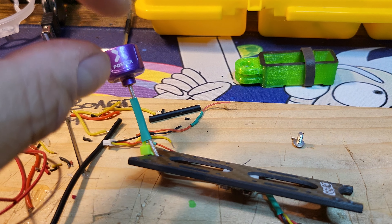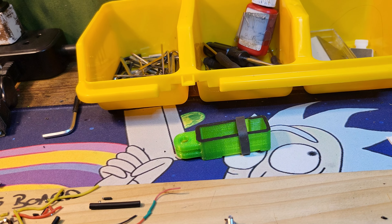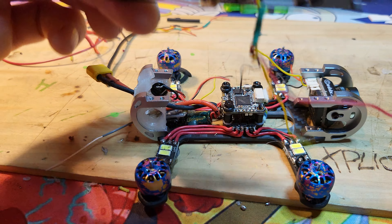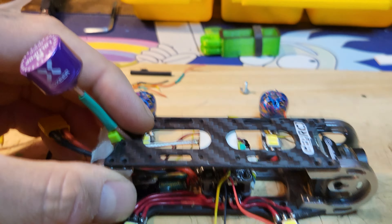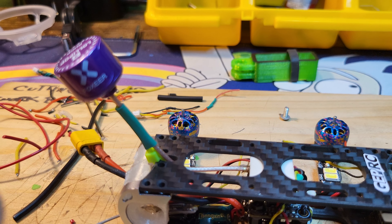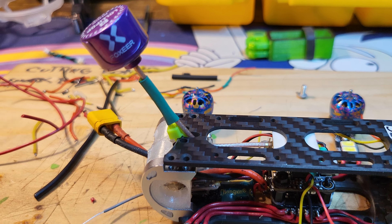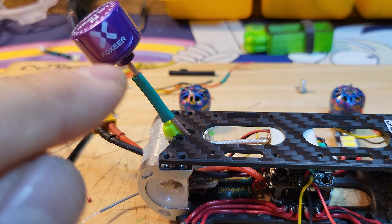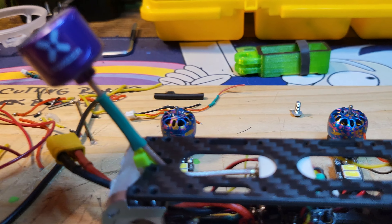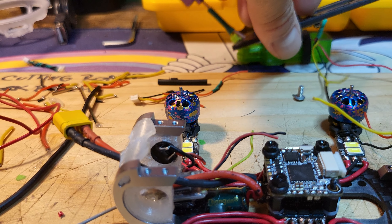You string it up along the antenna, then it sleeves back down onto the zip tie with a little bit of heat shrink. If you don't like the angle, you heat it up with your lighter, bend it in the position you want, hold it for a few seconds while it cools, and it changes the position. With bigger setups you can also add a little hot glue gun glue into the inside — it helps secure it even more, and when you heat it up it becomes pliable so you can bend it into the position you want.